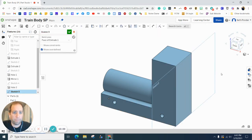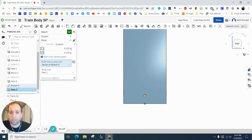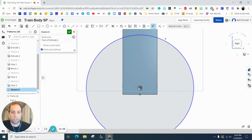Hit Sketch, select this back face, and put a point right here in the middle, going up a little ways. Dimension the height to 0.375 and hit the green checkbox. Make that a hole — click here — with a diameter of 0.25 and depth of 0.5. Hit the green checkbox. Now add another sketch on the back side, click Circle, center it right on that hole we just made, and make a large circle with a dimension of 2.35 times 2.